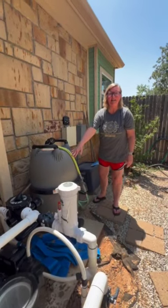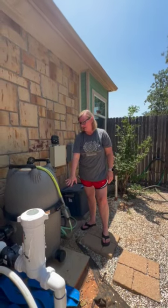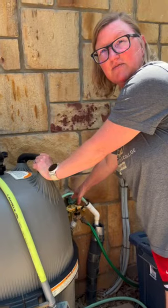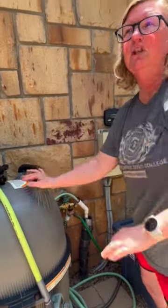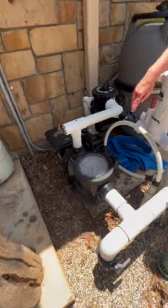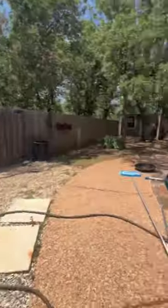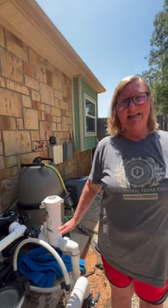This is a system I've set up to automatically fill the pool. It's on a timer — it goes off at 5 in the morning. As long as you don't turn this water hose off, it should work fine. It's been hooked up for about six weeks with no issues. If for some reason the pool does become low, you're going to want to refill it with just the black hose, which is hooked up right here. You can see that the pump did catch and now it's working normally. There will be bubbles coming out of the pool — just cleansing the air out of the lines. And that's pretty much it. I've left you written instructions that will help with this video.